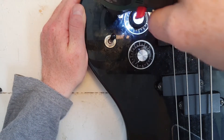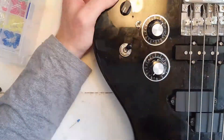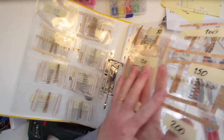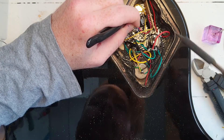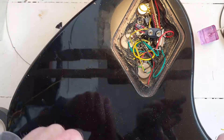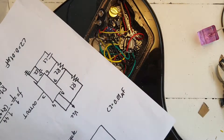After opening the bass again, I drilled a hole for the power LED. Since I would now have a lot more controls in the same small space, it was important to plan the placement well. I put the LED in between the pitch control and the power switch. I picked a small blue LED and drilled out a decently sized hole. I picked a 270 ohm resistor to go with the LED and soldered it to the positive leg of the diode. I then soldered the resistor to the on-output of the power switch, to make sure it lit up as soon as the oscillator was powered. I then soldered the negative output of the LED to ground. I decided to glue the LED into the body using 5-minute epoxy.